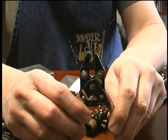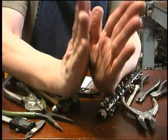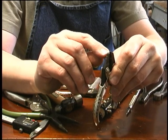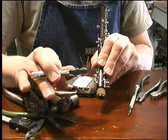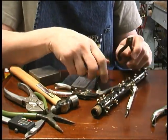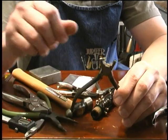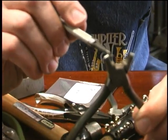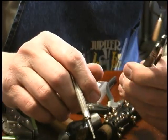I've got some other pliers. These better spring pliers open parallel rather than at an angle. This one has three little screws — you can arrange either one of these screws, take it out and put it in the primary position, and it will act as a punch to push out a broken piece of spring. These came from Ed Krauss and they're some of my favorite spring pliers. You can expect to pay about $50 to $60 for a nice set. This is the first set I had — they sort of work but they don't open in a parallel fashion. They have a little screw as a punch, but it's not hardened like it should be. They tend to wear and round out and don't act as a very good punch, but they are a little less expensive — I believe I got those from Freese Tools.